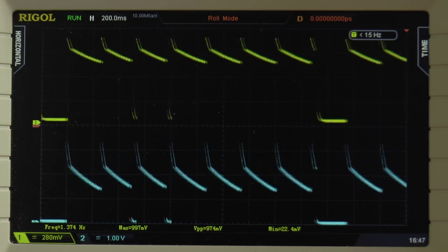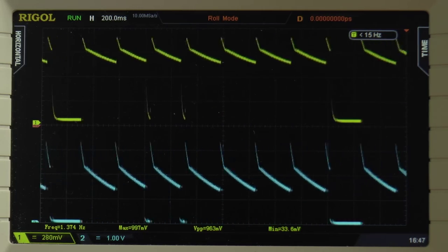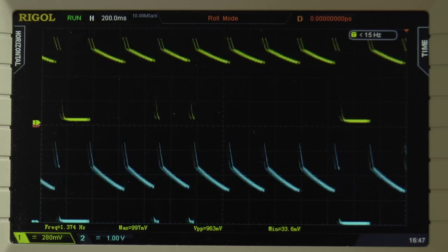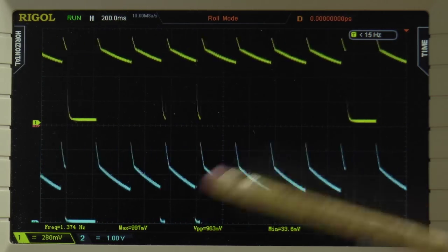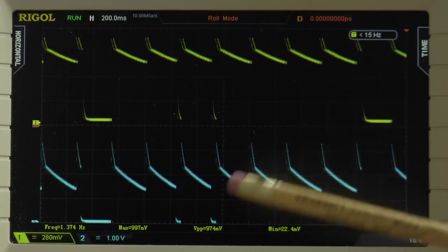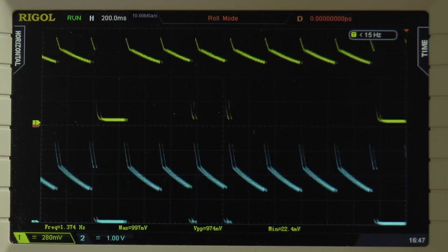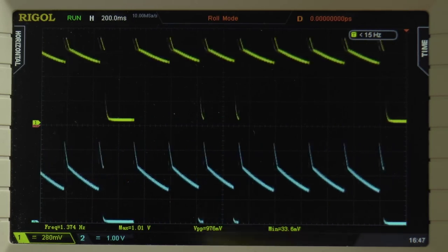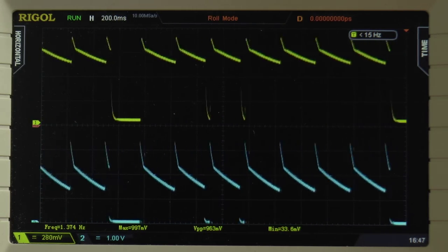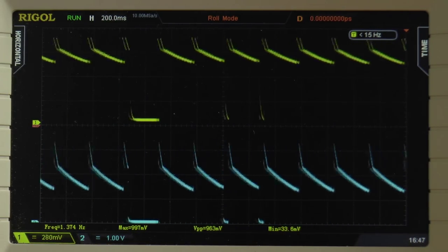But in most cases, because I have the board tuned in a way for all sound to be gone except the clicking and popping, normally you wouldn't notice this. And so, with my experiments, 2.2 microfarads pretty much takes care of all the problem. But if you are in a situation where you really still are having difficulties, you can switch to the 10 microfarad, which I'll show you up here.